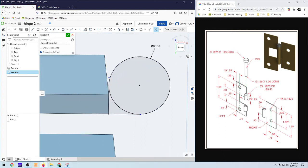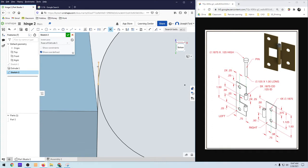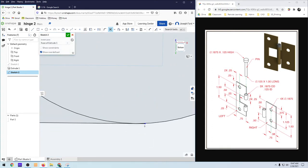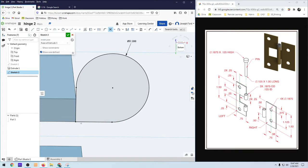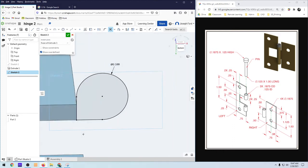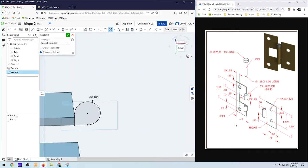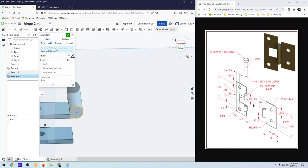Notice we're all defined except for these points, but that's okay. I'm going to trim off this edge, trim off this edge, and trim off this edge. Now we have a fully defined cylinder shape. I'm going to extrude it in the other direction — kind of backward from where I am — and that distance is a quarter inch, 0.25. Check it off and now we have the cylinder portion.